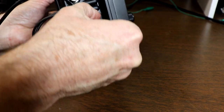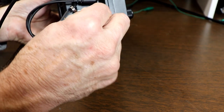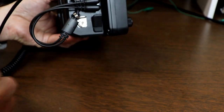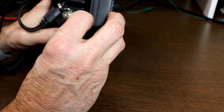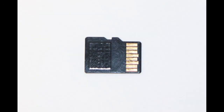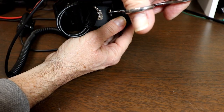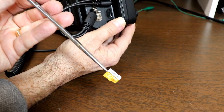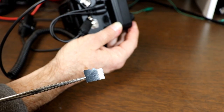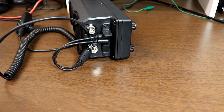The next thing you'll want to do is install a microSD card. The radio doesn't require one for basic operation, but there are a number of important features and functions that do require a microSD card in order to work. The card inserts behind a rubber cap, just below the speaker and microphone connectors. The card socket is a standard push-in to latch and push again to unlatch type. Inserting the card is pretty easy, even if you have relatively large hands. You want to make sure that the card is oriented correctly — the small notch on the side of the card should be facing up, and the metal contacts on the card should be facing toward the front of the radio. Inserting the card is easy, but if you have anything other than very tiny fingers, you will find it very difficult to extract the card. I found that a pair of forceps or tweezers made it much easier to get the card out. The card that I installed is a 32 gigabyte card — this is way more than you need, but it's what I had laying around and it'll allow me to record audio for probably days.